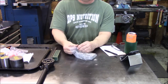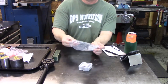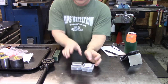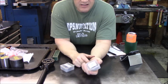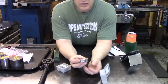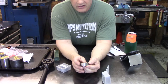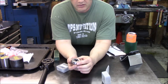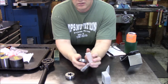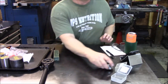I also hit up Grizzly because I thought I had a complete die set on my bigger dies, but when I went to clean some threads I found it was a 5/8-18 fine thread and I didn't have that die. I checked the rest and the only other missing one was a 9/16-18. So these are two-inch diameter round dies — that completes my big die collection.